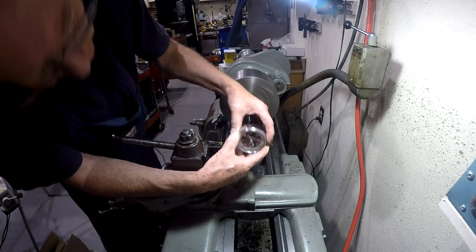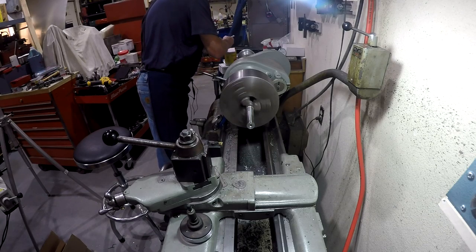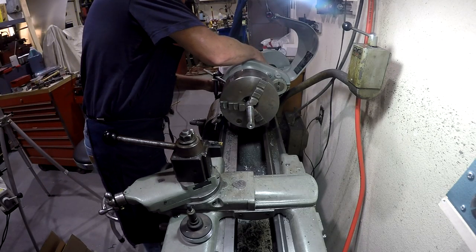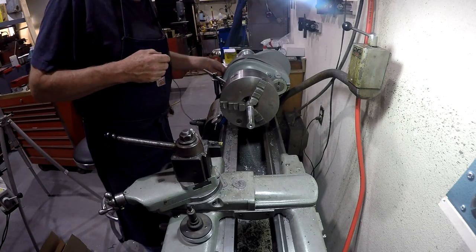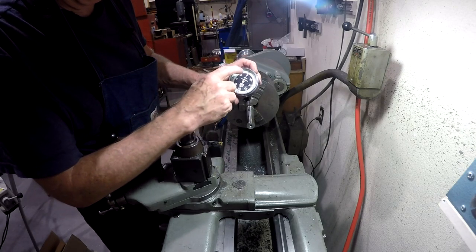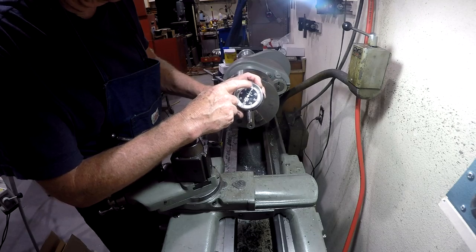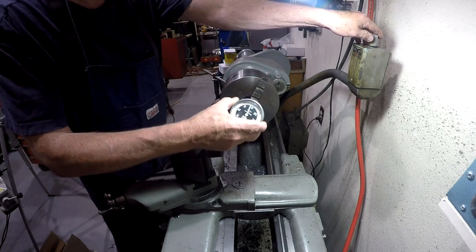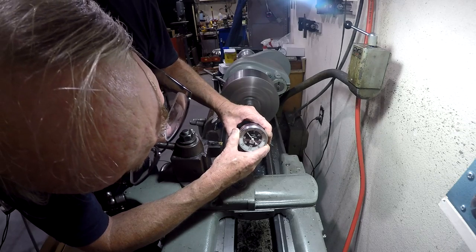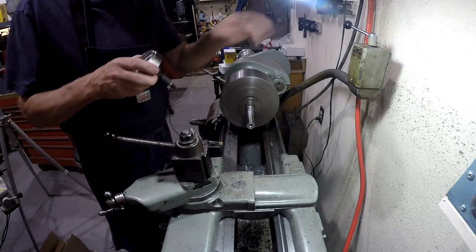About 350 RPM. Make up some kind of little sticker to put on there to remind me what these speeds are. I'm going to go back to the second one now. I think I misread. Each of the big marks is 200 RPM, and each of the little tick marks on the outside is 100 RPM. Or the odd numbered RPMs. So here we go again on the second one. So we're looking at about 510 RPM. So I had it right.